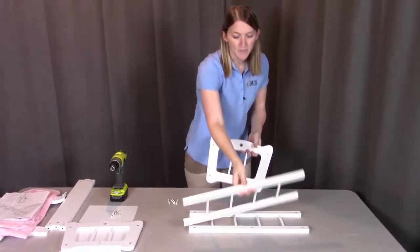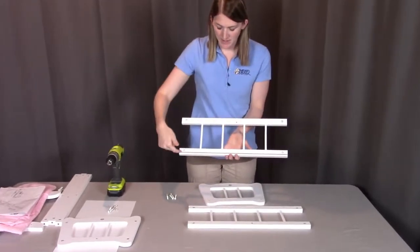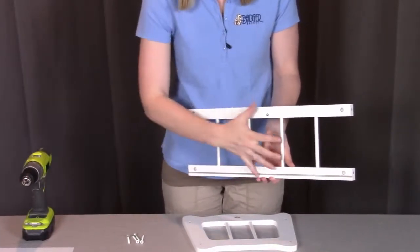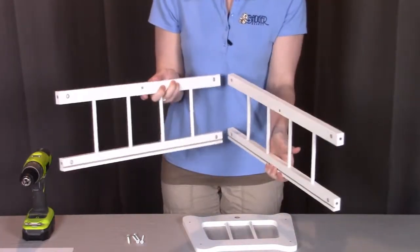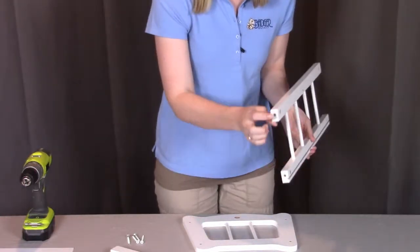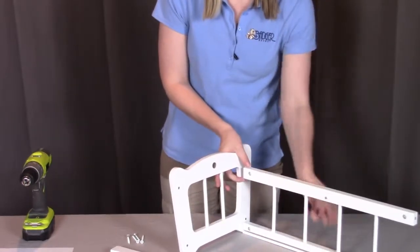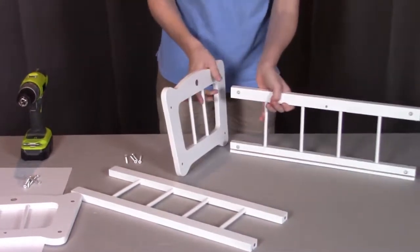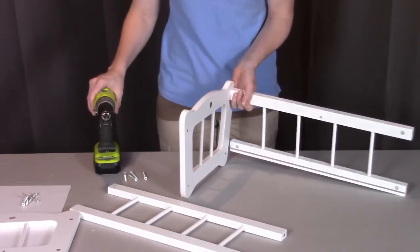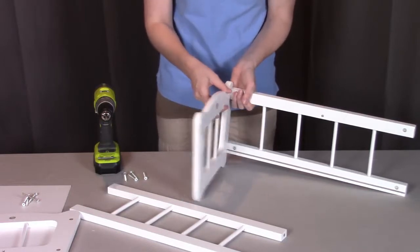What we're going to do is put these side rails onto these holes here, lining them up. When looking at the side, you're going to see one side that has a groove and these inserts — this is going to go towards the inside. So we want the groove on the bottom rail facing towards the inside, with both grooves facing towards each other and the inserts facing towards each other. These two holes on the end are going to align with the two holes on the side, and we'll screw all four screws from this side to attach the sides to the end panel. I'm going to use a drill to make it easier — if you use a drill, please have the torque set on low so it doesn't strip any of the pieces; otherwise, feel free to use a hand Phillips screwdriver.